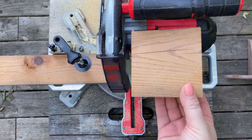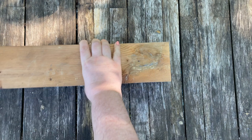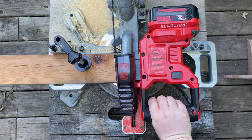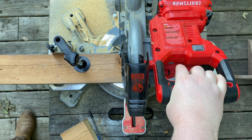This piece has a split on one end so that needs to go. If you're using salvaged wood like I am, make sure to double check that any old nails are gone before cutting. To make these planters we'll need two squares of wood. You can use the width of the scrap piece as your guide to get a perfect square. Mark it with a pencil and let's head back over to the saw. This wood is about two inches thick so I only need two squares for my planter, but if you're working with a one inch thick piece of wood, cut four squares total.